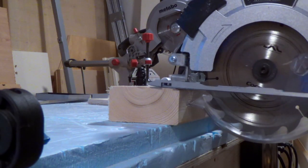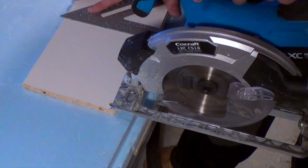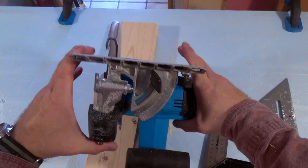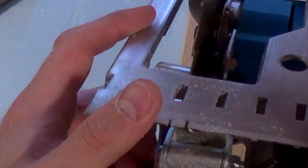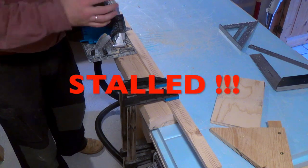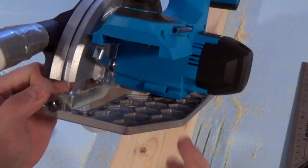To summarize: the blade guard is a piece of junk — most importantly it snags and will not open, and the lip is too large so it snags on the surface you are cutting on. The saw does not cut square, there is no micro-adjustment of the blade angle, and there is way too much play in the base plate fixing. The sight is completely off and non-adjustable. The dust collection is horrendous. The saw stalls all the time due to being vastly underpowered. And the lever for the locking mechanism of the plunge control is so weak that it bends when you push it down.